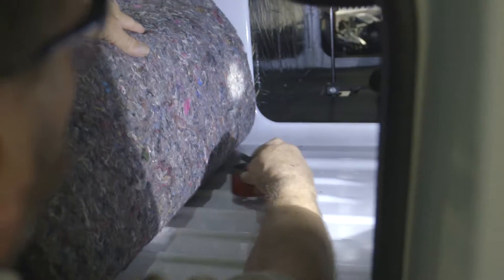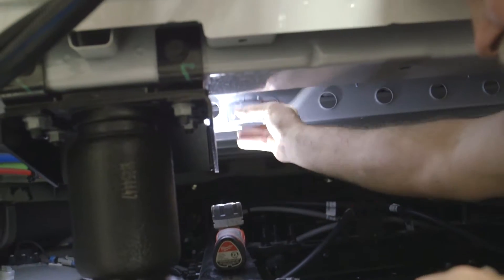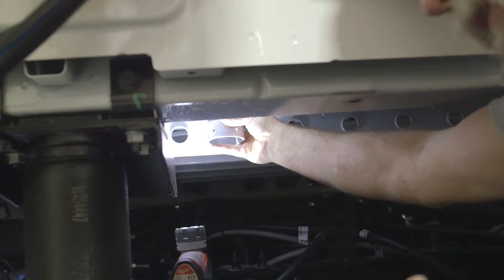Position the UBB on the bunk floor. Locate the floor collar and place it where you want to create the pass-through hole to the underside of the bunk. Check under the bunk for any obstacles prior to drilling. You will need clearance for a three-inch circle.